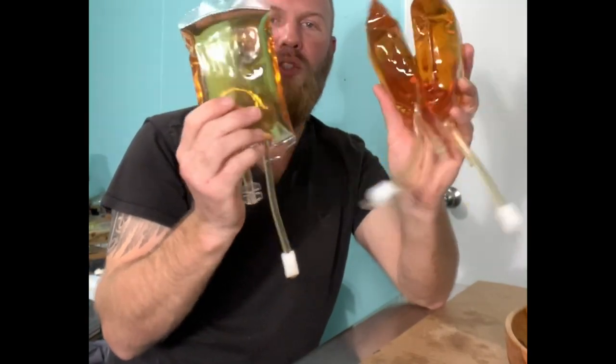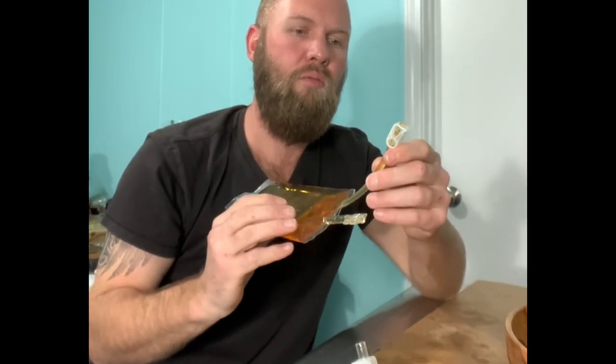Another thing — these little IV bags. I opened a brand new can the other day and a quart will fill roughly two and a half of these little IV bags. You can get them off Amazon and they work great. You don't even need Bloxygen — just pop the little tab open. When I get to the final stages of applying a light coat for the final finish, I'll just take a little plastic cup, cut the bottom out of it, and you don't even need half an ounce to apply it with.